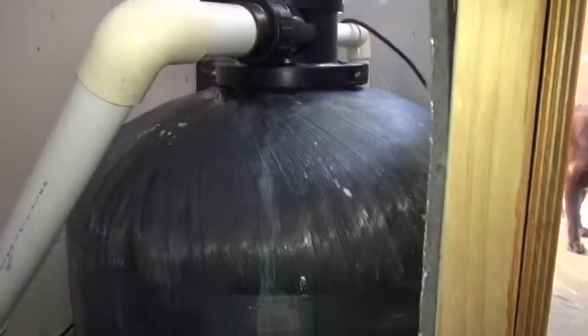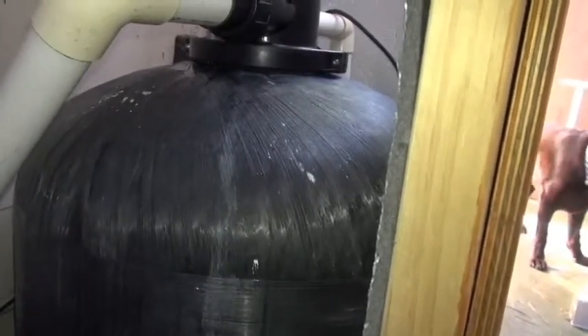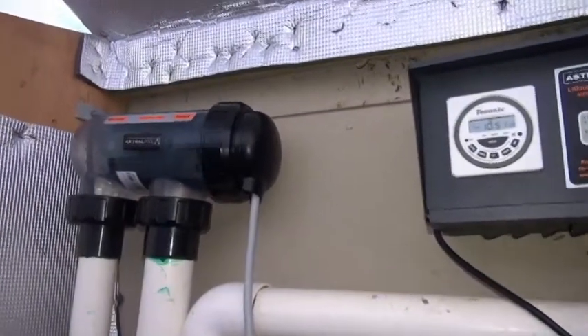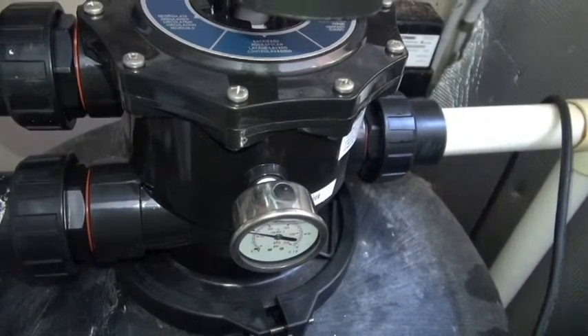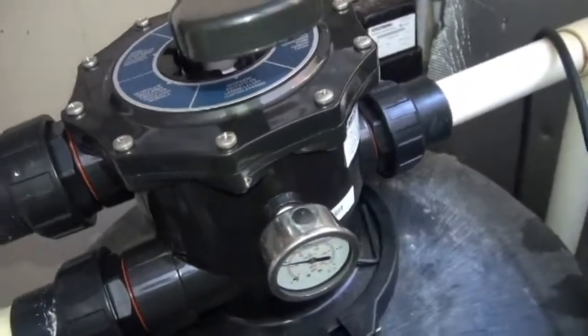We also need to take into account the size of the filter. This filter is a reasonably sized filter — it's a 28-inch — and this is a 2 horsepower pump with quite a lot of pipe on this pool, which means it can handle the speeds. If we look at the pressure gauge as we increase speed back to the 1800 RPM level, the cell is completely full and the gauge has moved up to around 60 to 70 kPa.